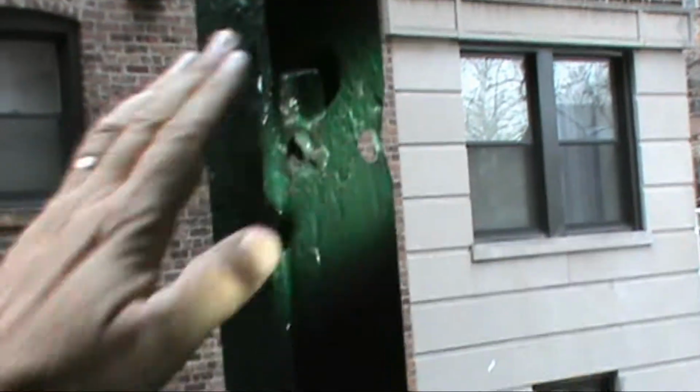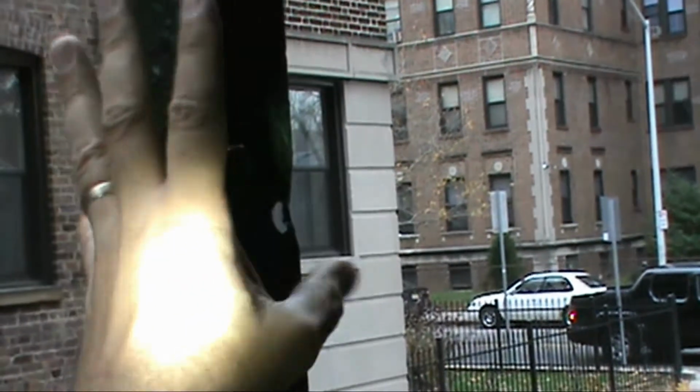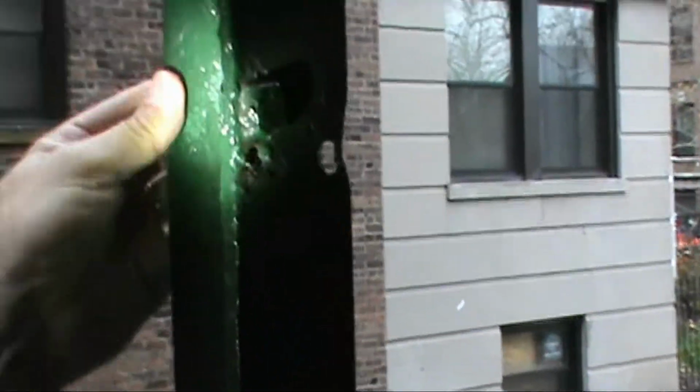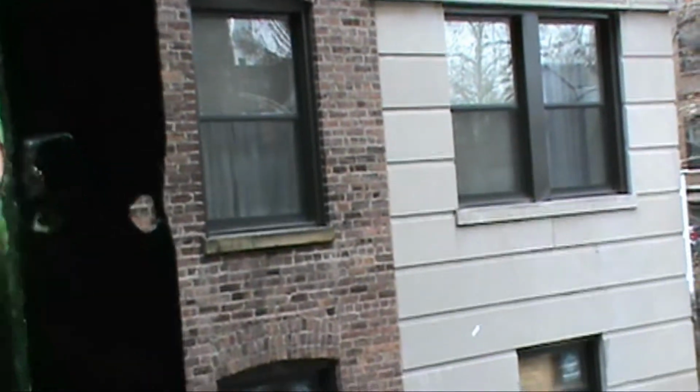Another cement situation on this corner. On that corner right there. Another cement situation. And we're starting to get down to the worst part of the fire escape. Now, if you come in here and you see this side, they used to have all those cast iron knuckles used to lift furniture. Some of them were here and they got rusted and they actually ate the steel. So this piece of steel needs to be reinforced. But look, the nut is gone, the head is here, and this is down to 1/8 thick steel. This used to be 3/8, now it's down to 1/8 on where I have my fingers.